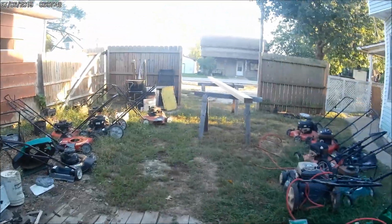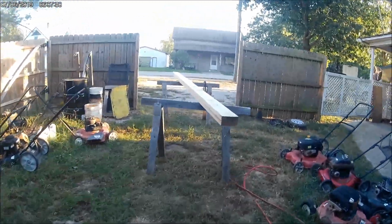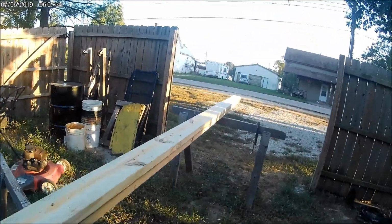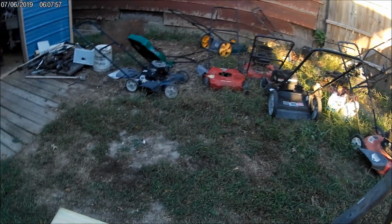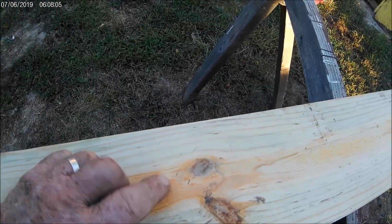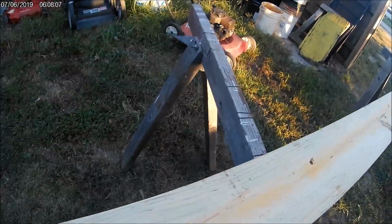I got it out there on the porch. I'll show you in a minute. But I want to put it somewhere in the middle here. I use my son's nail gun, and I guess that's up on about 150 pounds. He puts them right on down in there. I mean, you can't hardly see it. It's at least a half inch down there. I should have had it on the regulated valve in there, but I didn't. Anyway, this won't trip over the hose now.